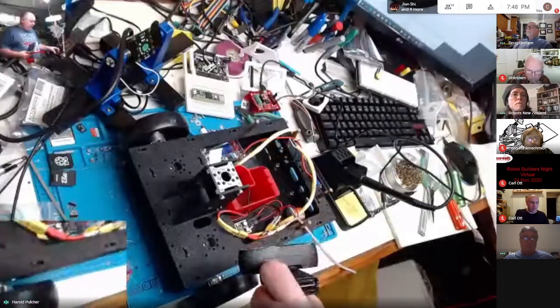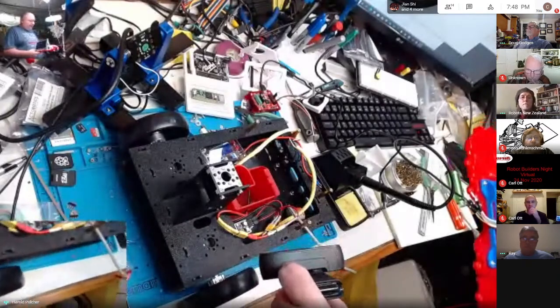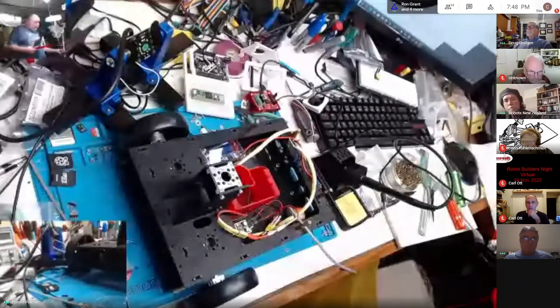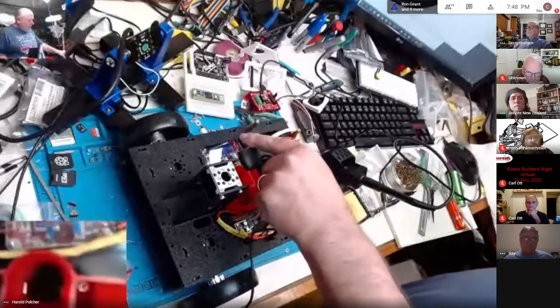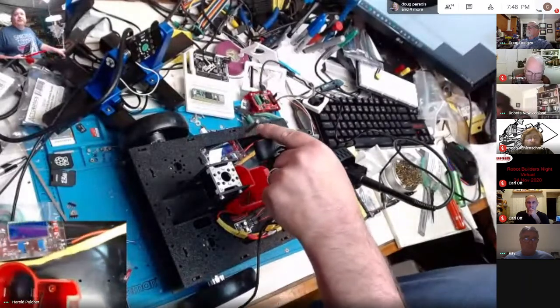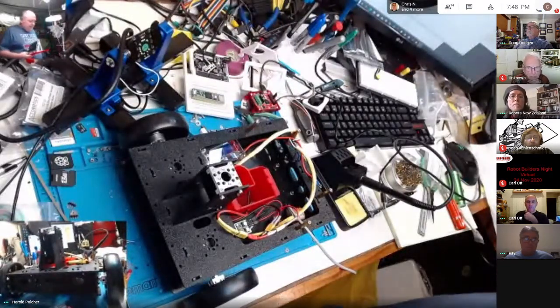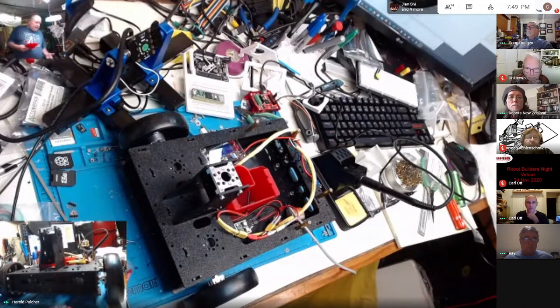Are you going to use one of those for your screen then? Yeah, I think I can use that same one for powering everything because I'm only at about an amp and a half right now. And even with your motors running, the motors are running off of this 12 volt buck converter over here through the motor controller. Yeah, got you. And those motors currently aren't pulling too much. Of course, I haven't done a whole bunch of research. I've only done the no load. They're a couple hundred milliamps apiece or something. But as soon as I put load on them, I'm sure that'll change.